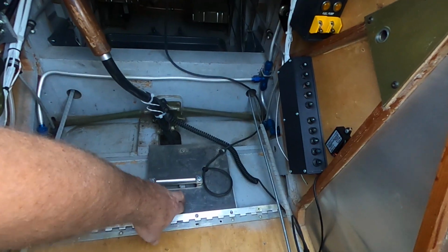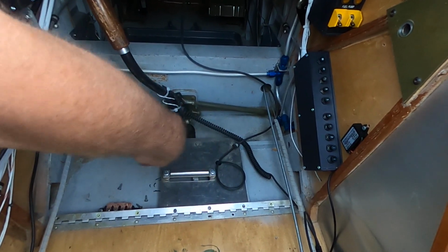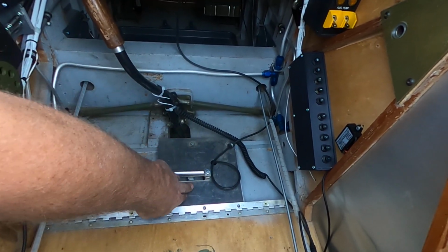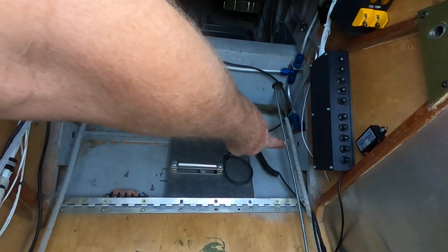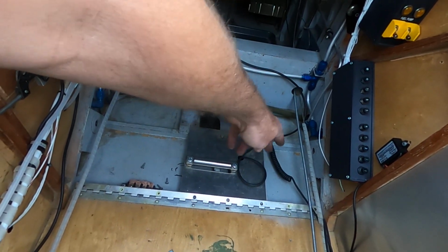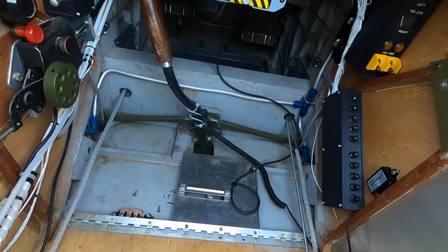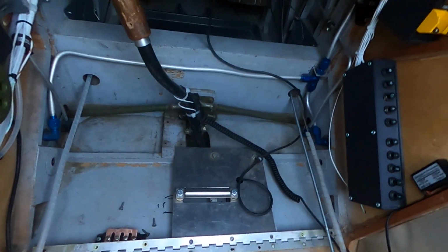Normally, where this plate is, and I still am going to take this plate out, is where the retract mechanism per the War Corsair designs was, right in here, and then the mechanism that actuates them goes through those holes. And then out from there, there's a pair of universal joints because of the inverted gull wing to get down to the landing gear. So you can also see I'm working on some other things.